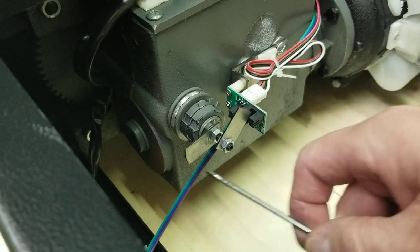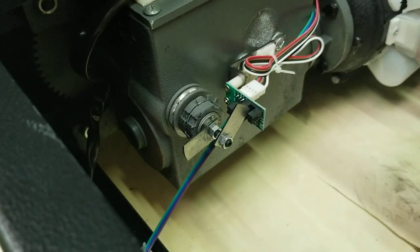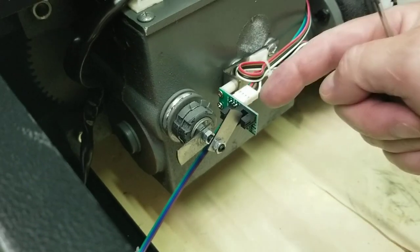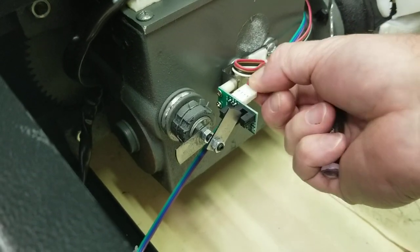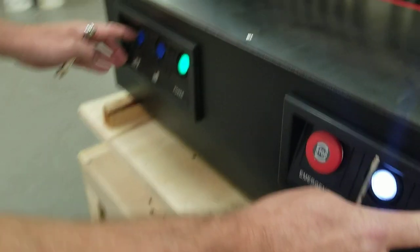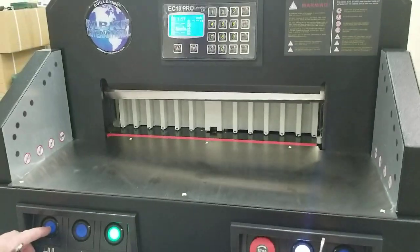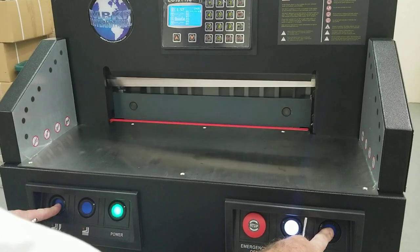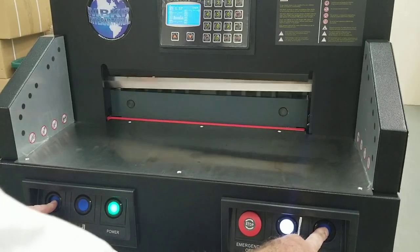You can adjust these if they're going too far. But if you're getting an F3 or F4 sensor fault, this wire could be messed up or unplugged, or the sensor itself could be bad. Here's an example with the plug unplugged — it doesn't know where to stop and just keeps going up and down, eventually erroring out with an F4.